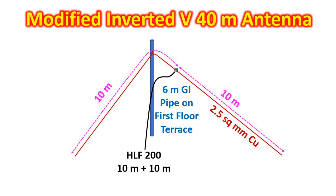I am wondering whether the one I purchased is a 16-feet version. I am still having a coil of HLF200 cable tied to the mast, which I presume will act like a common mode choke, though I have not calculated the inductance value. The coil has been made just beyond the first 10m of cable where there is a joint with an SO239 barrel connector.